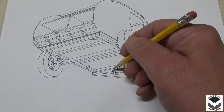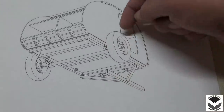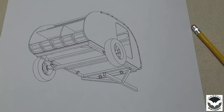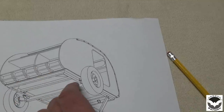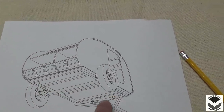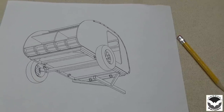So when we drill through, they're actually going to drill through and secure to the frame instead of through the top and bottom floor and the foam in between. We're going to make sure that this thing is solid to the frame. So we're going to go right through the framing itself and the floor. And before we do that, we have to make sure that our cabin is setting in the proper place. We don't want it too far forward, we don't want it too far back, and we want to make sure that we're side to side so that all of our little tabs that we have in place line up with our floor framing, so when we through bolt, it actually goes through the framing for the floor.